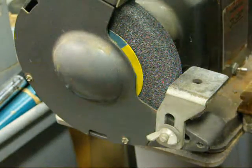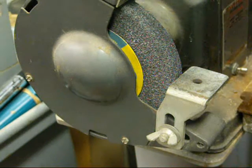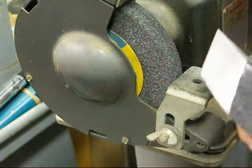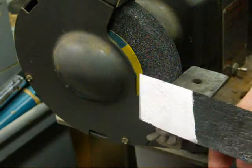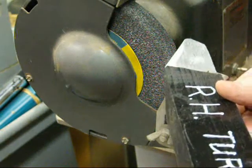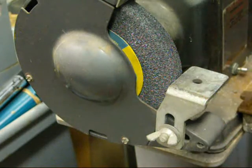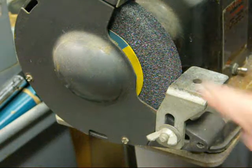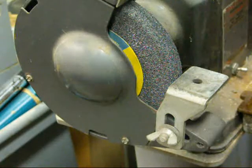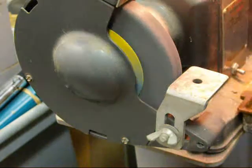I've raised the glass safety shield a little bit so it's out of the way. Be sure and wear your safety glasses when you do this. Now what I like to do is grind this surface first, moving it back and forth across the wheel. This is the coarse side. You'll want to use your coarse wheel and then finish up on your fine wheel, and maybe even hone the thing if you want to. So let's turn this on and see what it looks like.